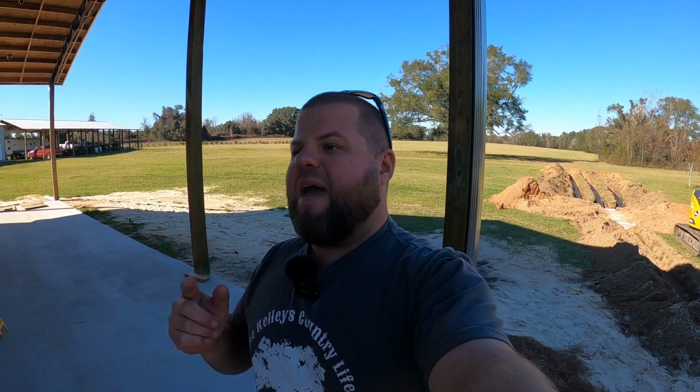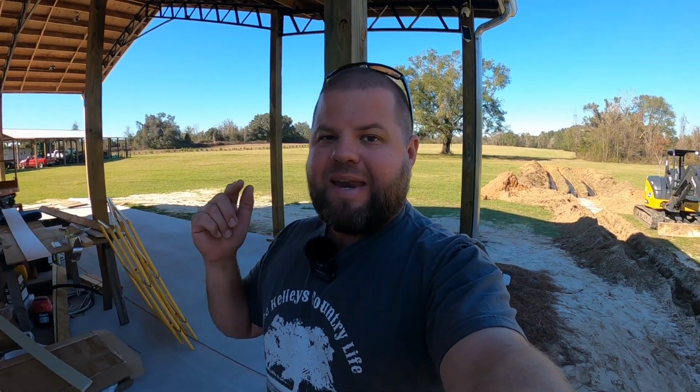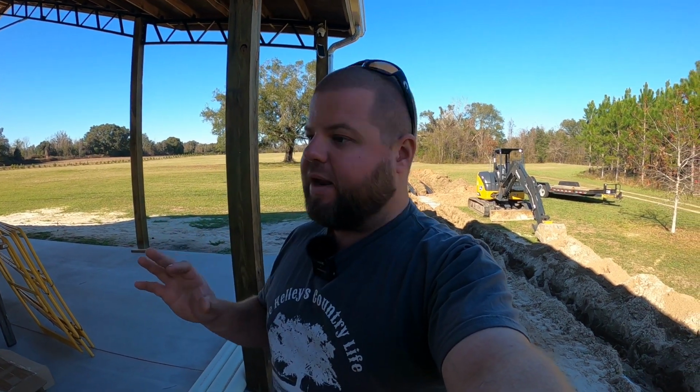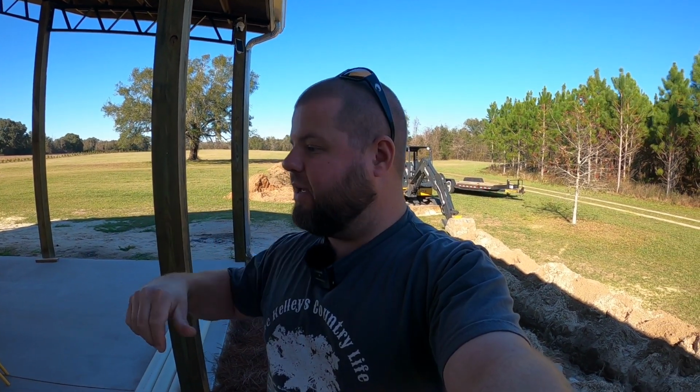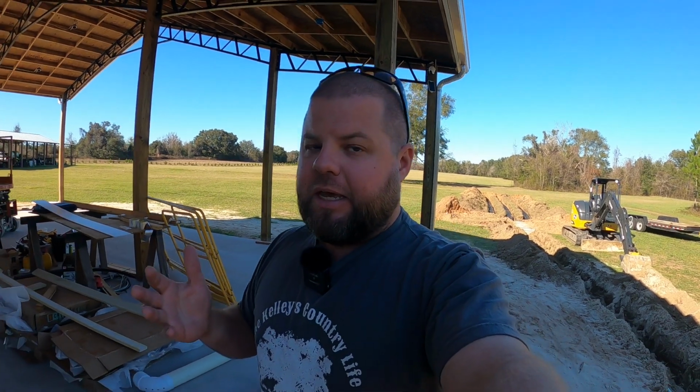Keep this in mind. If you ever think that you may add on to your home, we know that we most likely are, now is the time to upsize your system. There's no penalty, no nothing for doing that. You can oversize. But if you were to add on down the road, one of the first things they're going to look at is, is your septic system designed to handle a larger home? If not, well, guess what? Now you're digging up, paying all the extra money, digging up your drain field, adding on to your system. Who knows what all you're going to change? Pulling permits, getting checks, a nightmare.